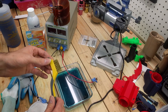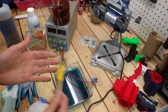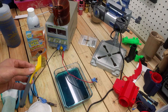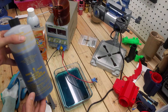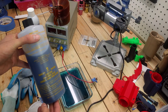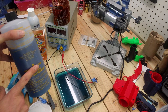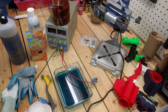A wire brush is great for cleaning the finished product — it gives the copper its shine once you're done plating. Sandpaper is a bit too abrasive. Then you need your electrolytic solution; copper acetate is what we're using since we're dissolving and coating with copper. I'll have a link for that in the description as well. Those are the necessary supplies, so let's get started.